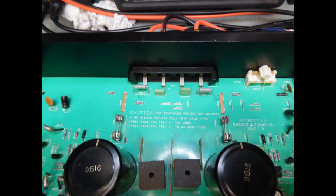I want to bring this to your attention: this amplifier does not have a speaker protection relay output system. What it utilizes is two fuses, 20 millimeter by 5 millimeter OD, and the value of them is time delay 6.3 amps. At some point these fuses must have been replaced, because when they were removed from the cradles, the value was fast blow 10 amp.